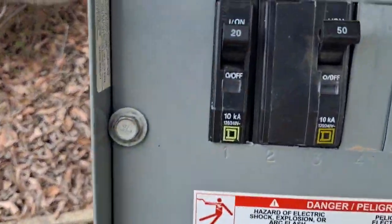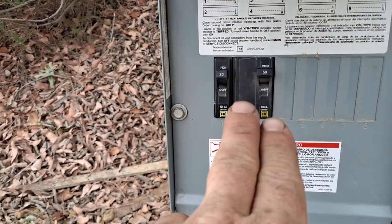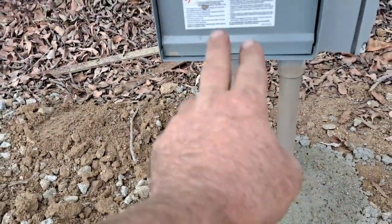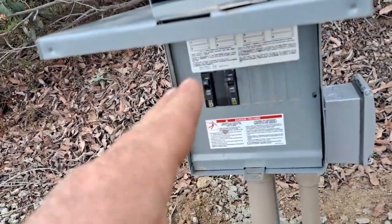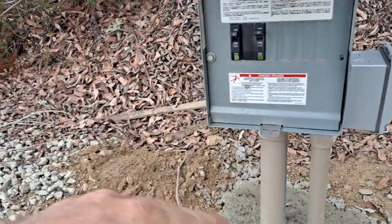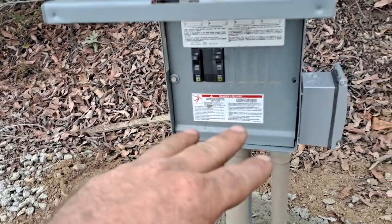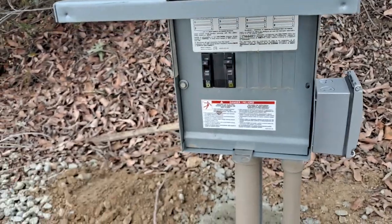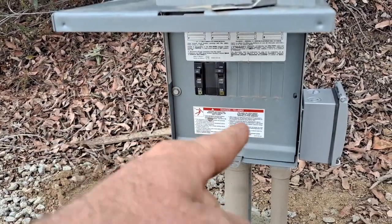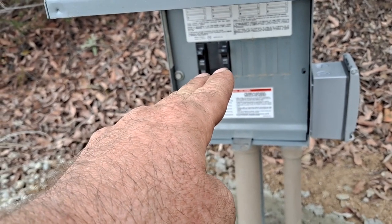And from there, I pulled this 50 amp right here, second one in, a 50 amp 240. So it's got 2 hots coming down, and the hots go into this and the ground. I didn't pull a neutral. There's no real need for me to pull a neutral down to the well. So basically I've got 2 big hots coming in, and a neutral that land back in this panel, and then a ground that lands in the panel on the bus bar, and then a ground coming off of the bus bar going down, and 2 hots coming off of that 240 50 amp coming down.